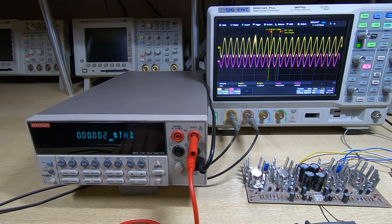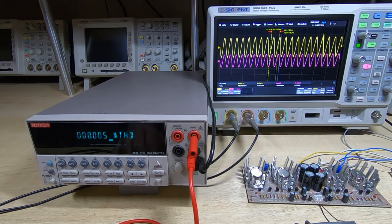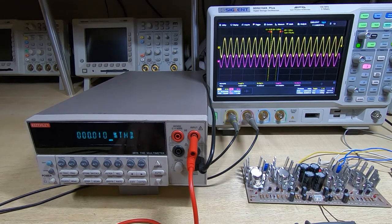Now the output power is specified at 100 watts, but it's quite difficult sometimes to determine actual output power for an audio amplifier. I assume they're talking about total music output, and that's spread across different frequencies. What we'll probably find is that the amplifier will give a lot of power at low frequency, and that will diminish at higher frequencies, but that's not necessarily a big issue. If you're driving an audio system, then you tend not to put out, comparatively speaking, a lot of power at the higher frequencies. Most of the power is going to come out at the low frequencies.